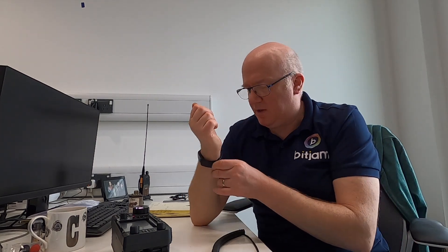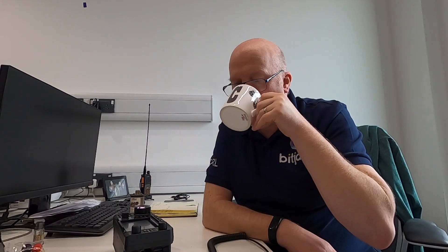I've got the mag loop tuned in and the SWR is about 1.5 to 1. I'll run this for about 15 minutes and try to make a couple of contacts, and at least I'll be able to check who else has heard me. I suspect I'm probably receiving better than transmitting — I'm only putting out four or five watts into the mag loop inside a building that's a bit like a Faraday cage.